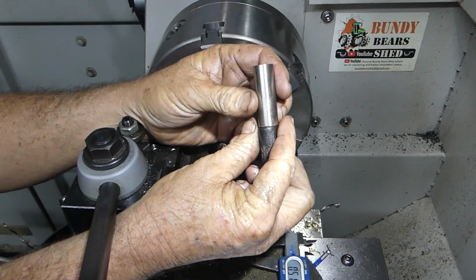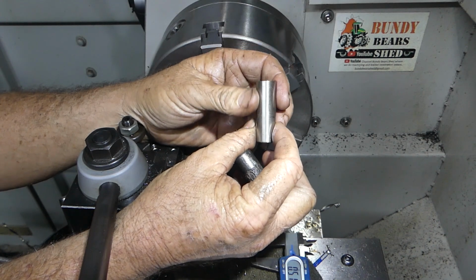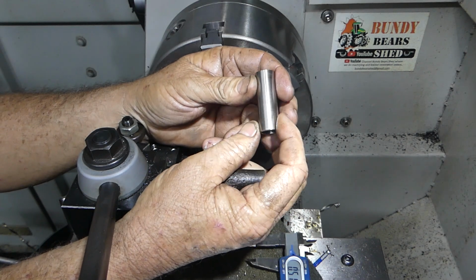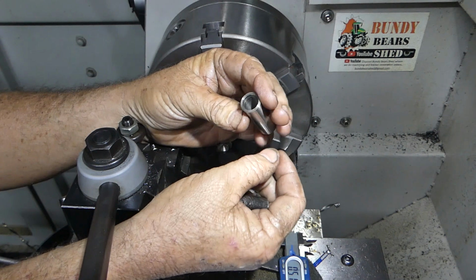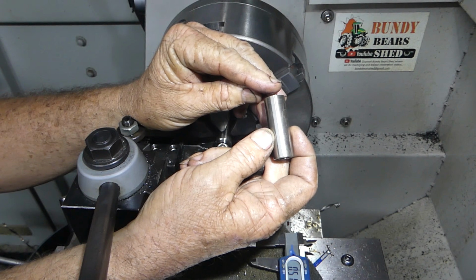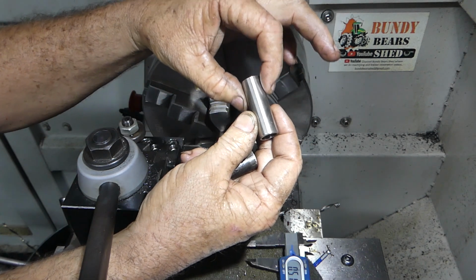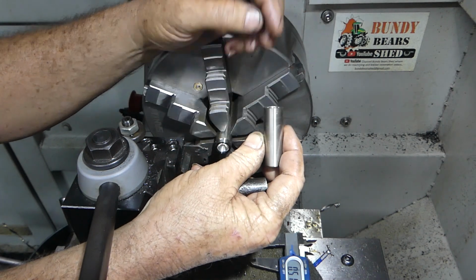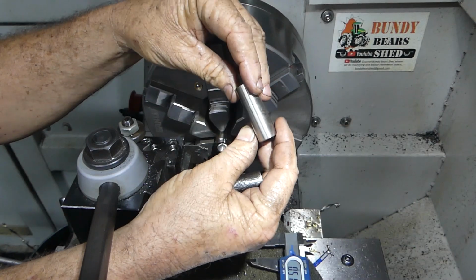That should slide in the head nicely. So we're actually bang on. We wouldn't be even half a thou. So probably if I chuck this in the freezer, and pop a bit of Loctite down the holes and just go boom, boom. I probably should make a little stepped punch just to pop him in, as this sits below the head, probably 1 or 2 millimetres. So I probably should make myself a little punch that'll be just smaller than this outside by say 5 thou, and will sit down in here. So when I go to put it in, I can just pop him in quickly and away we go. So there you go. That's just a bit of machine.